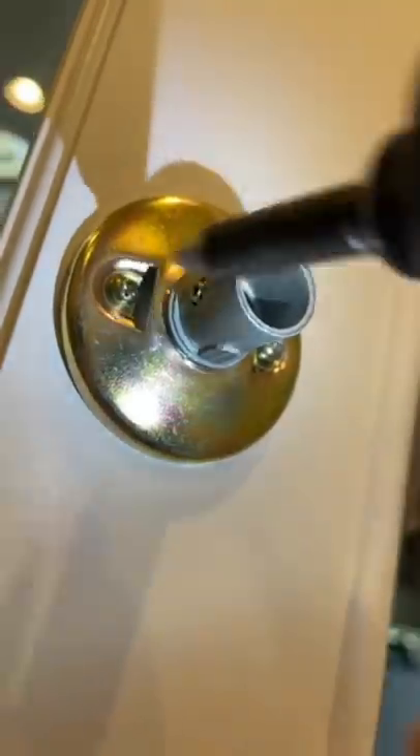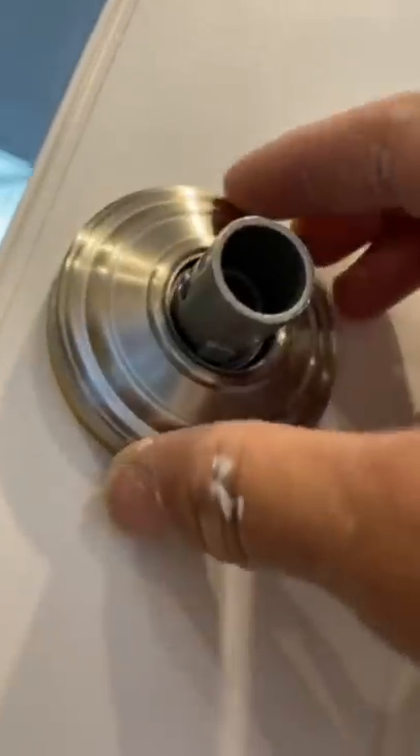Also, these doors are sprayed so I can't necessarily use a brush because it will leave brush marks and it'll be very noticeable. I recommend getting a foam roller and adding a little bit of Floetrol to the paint, because the foam roller does leave a little bit of texture, but with the Floetrol it's going to make it look like it was sprayed.